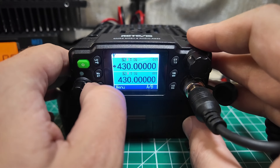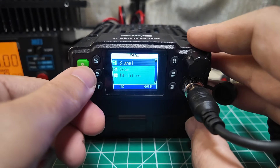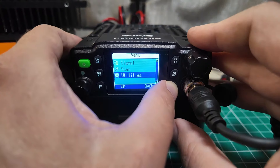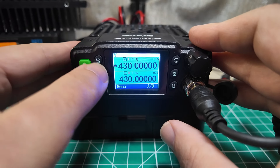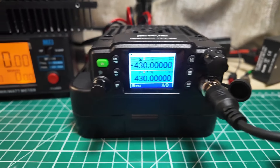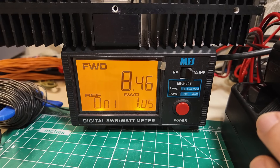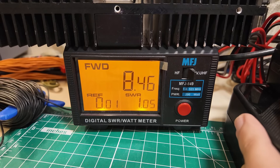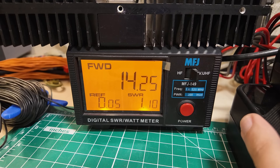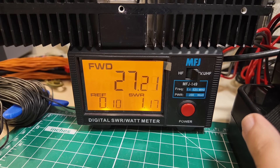Our power is set to low. Looking for power settings — Utilities, Radio setting. It just winds up being defaulted to that top button where it says LO — so low, high, medium. Let's take a look over at our power meter. We are on low power: 8.45 watts out. On medium power it's 14.25 watts. And on high power it's 27 and change.